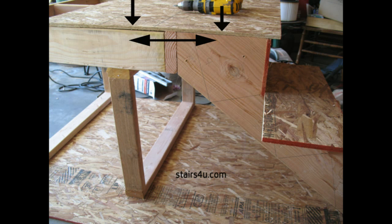For example, let's say that you put three nails in the stair stringer through the landing sheathing and then three nails into the floor joist or the landing joist. It would almost act like a metal strap — that's how effective the plywood or sheathing or oriented strand board works to tie things together.